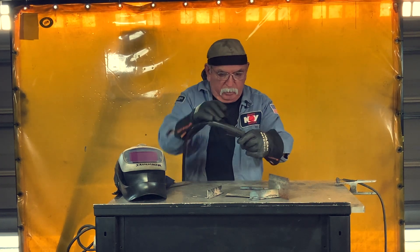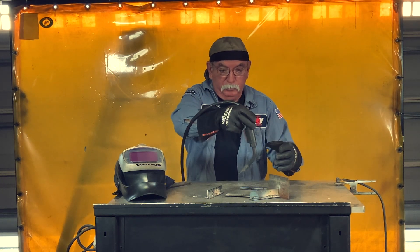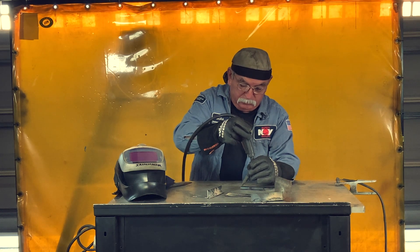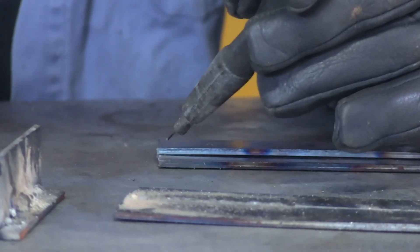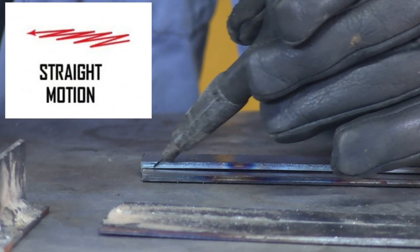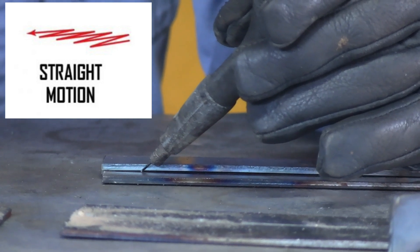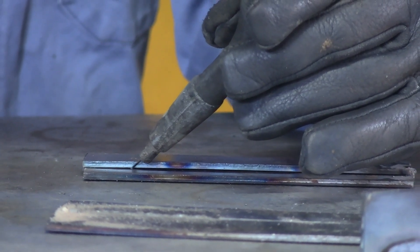When you get into welding, you're going to be out of position a lot, and you've got to get used to it, but you've still got to maintain your angle. This one here: 45 down, 45 in — there's a corner joint. And this one here, just in and out. It's thin enough to where the weld puddle will reach the top and bottom of that plate.